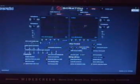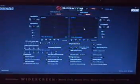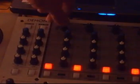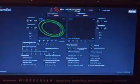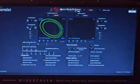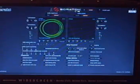You have a little box here and a little box here. Take a Serato Scratch Live vinyl — remember these? — put it on your turntable, just like that. Start the record up, throw the needle on the record. Now you hear that tone? Right up here on our mixing board — remember how we plugged into phono and line? We need to switch fader one and fader two to the line position on both of them. Now look at that box again. You see that goofy oval? What we need to do is make that oval round in the center to the best of our ability. We have a left and right balance here we can do that with, and we have a PA balance we can do it with over here. That looks like a pretty good circle to me — it's not absolutely 100% perfect, but that's a pretty good circle, and that's what you're looking for.